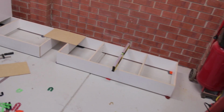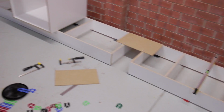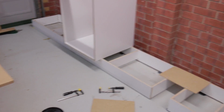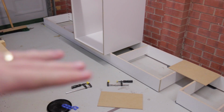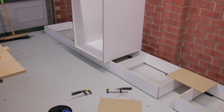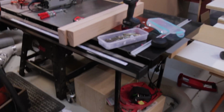So I've got the plinths, kickboards, whatever you want to call them, level. Whoever poured the slab for this garage is awful. Normally you have a gradient going towards the outside so that if water gets in here it'll drain out. Or you might have one towards the very centre where you might put a drain, so about there. I don't have a drain.